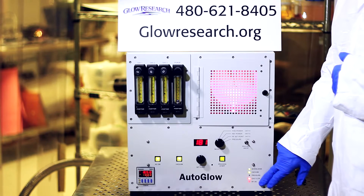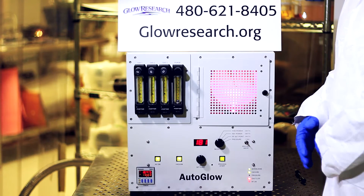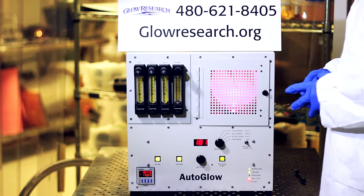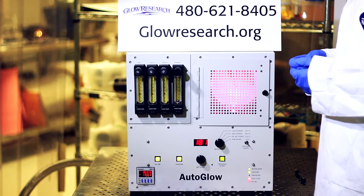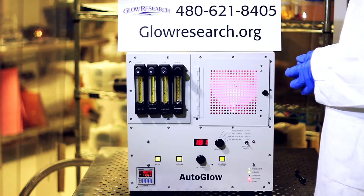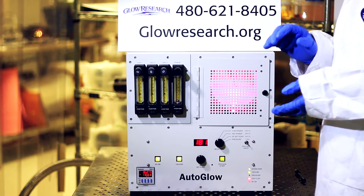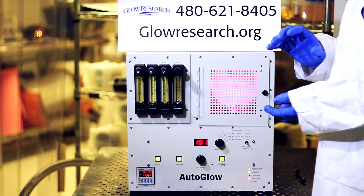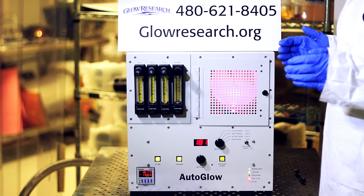The electronics are on the back side of the front panel and control the entire system. The system is very easy to operate for your operators or if you have multiple people using the system. It has a timer that automatically shuts off the process, up to three process gases, and a nitrogen or air purge that can give you a soft vent of the chamber back up to atmosphere. Many people like the quartz chamber because you have very little sidewall interaction, very good rates, and very good uniformity due to the quartz chamber and the gas distribution tube inside.